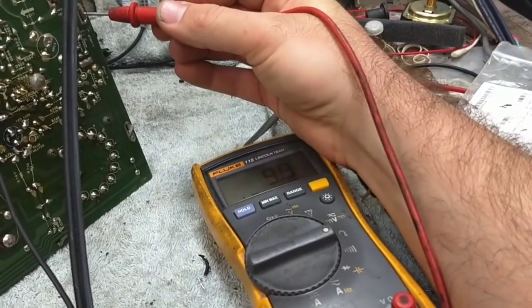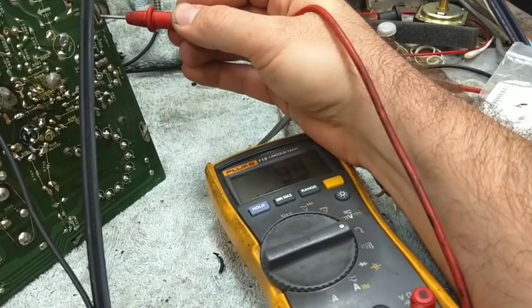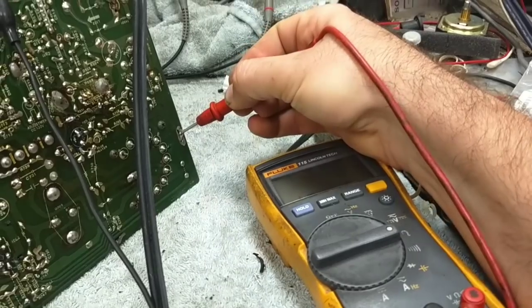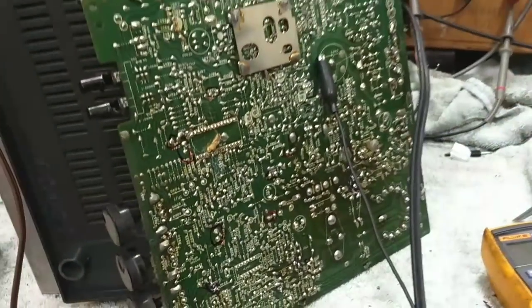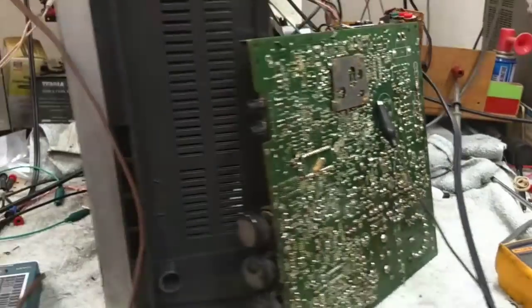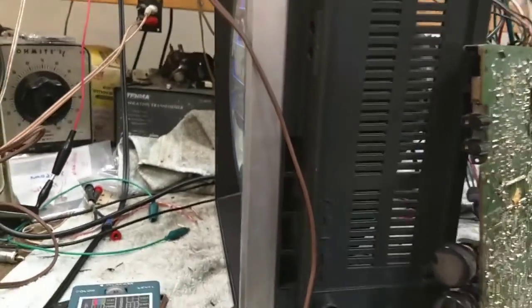This ground back here is pretty close to potential — only 8 or 9 ohms difference. This shield here which is grounded is at ground — about 1 ohm. So there's some sort of ground integrity problem on this board that's not quite right, and that's probably why we're getting deficiencies. That's probably also why we're not getting color control.